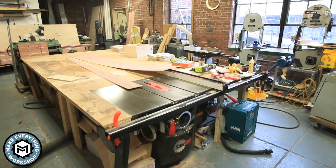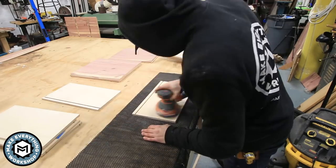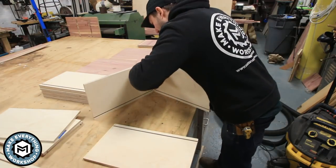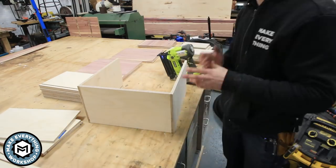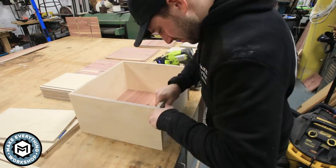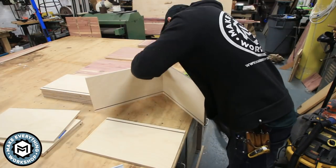I decided to use quarter-inch aromatic cedar for the drawer bottoms - I thought it'd give a nice look and effect. For the drawer faces I'm also using the aromatic cedar three-quarter inch plywood, and they're going to be edge banded. Initially I wanted to use solid cedar but the material I could get wasn't up to par, so I felt it would be best to just use the plywood again. For assembling the drawer boxes I use brad nails and glue, then slide in the quarter-inch drawer bottom and add the back. Half-inch Baltic birch is really stable plywood - I sand the top edges and move on to the next one. It's a very repetitive process but gives really consistent results.